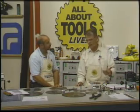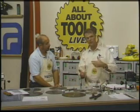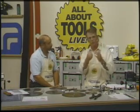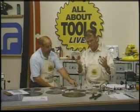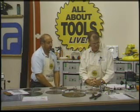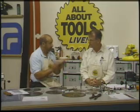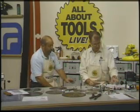But you want to pay attention to how those bearings are performing, because if you start to get the feeling that something isn't right on the bit, that it starts to get rough or something, you want to stop your cut immediately, because the object is to help save your work. We said last week that lubrication is key, always, with a router bit. Absolutely. Well, with a bearing, rather.